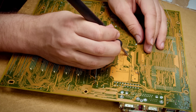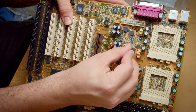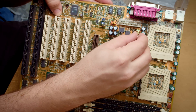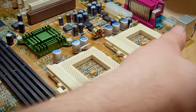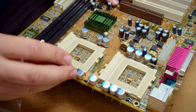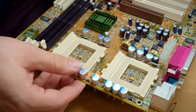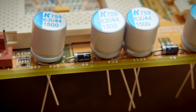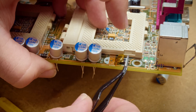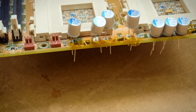Reinstalling the capacitors was fine though. For some reason I had this memory of something like this motherboard having the polarity markings reversed on the silkscreen, so I was a little more paranoid than usual about matching the way the new ones were installed. All the markings were correct in the end, which makes me wonder what I was remembering. A more difficult part of the process was putting in my alternative polymer caps. Since these were the only ones I could find that matched the electrical specs, I had to concede on them not being an exact fit. They were close, but slightly larger diameter, which was a bit of a shame because they are much shorter, which would have made cooler compatibility better instead of worse. It was also pointed out by chat that these larger diameter parts were getting worryingly close to some exposed through-hole components that could be shorted, so I put some polyimide tape over them before the final installation.